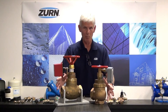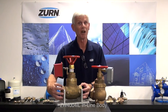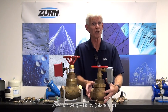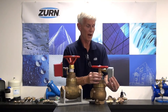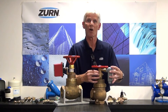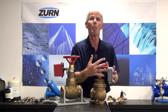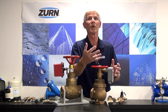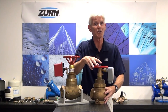The models that we see right here are both ZW4004 series. This is an inline version, ZW4004 IL. And we have a standard angle valve, ZW4004. These valves are equipped with some features and benefits — the ZW4004 has what we call an integral supervisory switch, something that we install here at Wilkins. When these are installed in a fire protection system, they want to monitor these valves in an open position, so the supervisory switch would trigger alarms if somebody came by and shut off the valve. This model is ZW4004 SS.